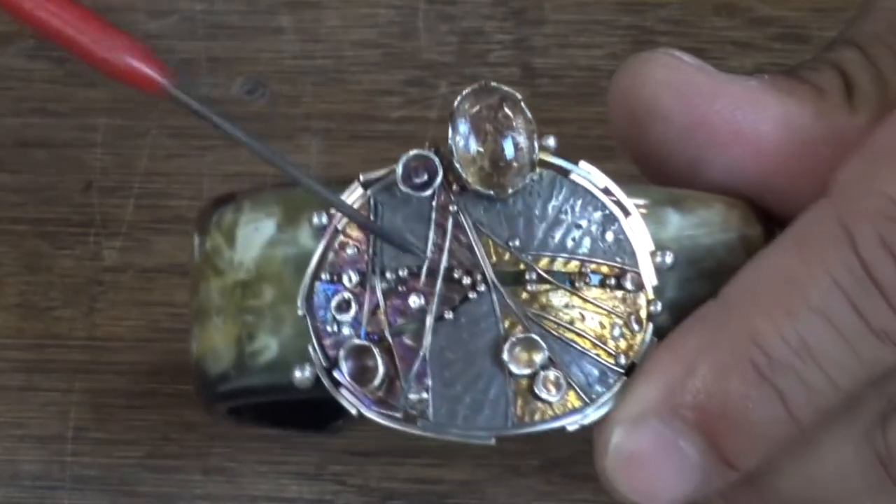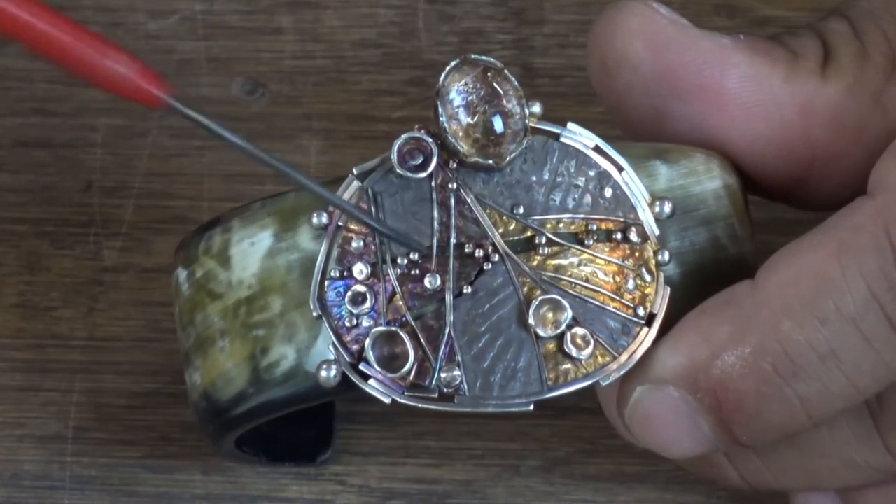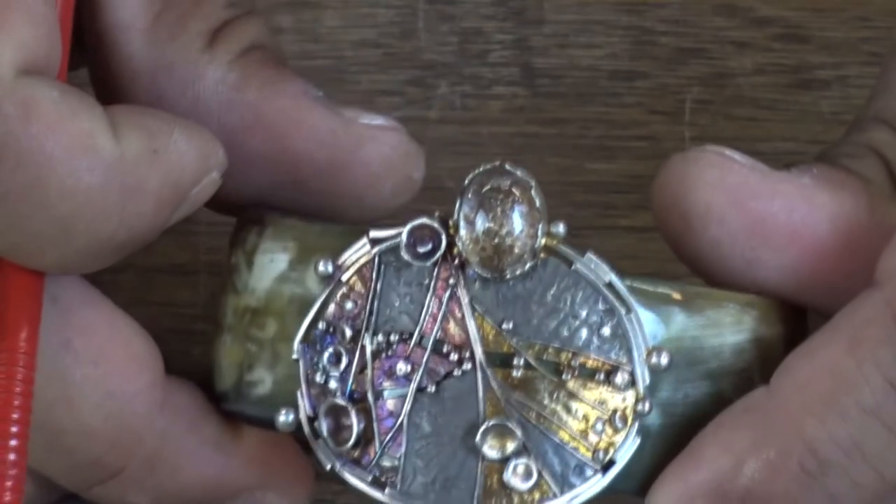Here's another example — the water cast, the granules, the wire — all fused on. So again, in this class I'll teach you how to fuse, how to recognize what you're looking at during the process: torch control, heat deflection, things like that, to make a really good joint. This is walking a very fine line between melting the piece into a ball and fusing it into a strong connection. Let's get you walking, then running, then flying. Turn up the air conditioner and get those torches ready — it's about to get hot.